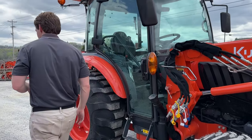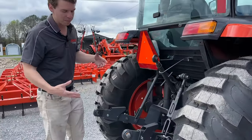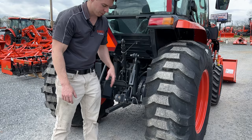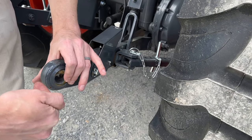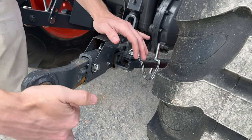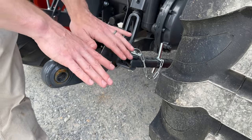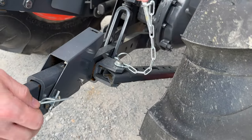Moving to the back of the tractor for hooking up rear implements — the Grand L Series is amazing because it has two really nice features: telescoping lift arms and telescoping stabilizers. With the telescoping lift arms, if you back up to an implement and you're two inches away, you can just push this lever, pull it out, the pin arm will go in, and you click it back into place. You don't have to worry about backing up another inch or two.